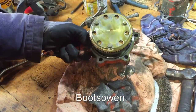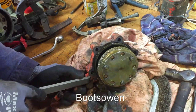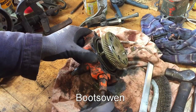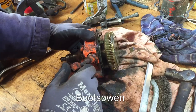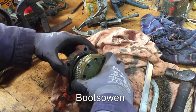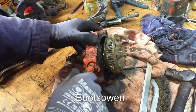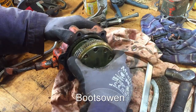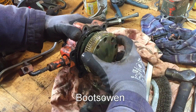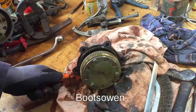Set that aside and let's have a look at this one — cast iron housing. There's a dog there. So you can have — let's see which way was it — like this. I think you could have two wheels, one wheel, or gears off. Okay, so that rotates like that separately, so that's spinning all the time. Then you put on one gear, and when this engages it'll go through one set of holes, and if you go the second way it goes the whole way across. It's quite simple, quite complicated — quite a snazzy gearbox.